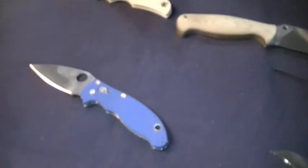And toughness, you mean the ability of the knife to take abuse, hits, shocks? I'm basing that basically on a Charpy test. They take a piece of steel, it might be notched in a given way, and then they drop a given load on it until it snaps the steel. And the amount of pressure or force it takes to snap the steel is an indication of toughness. With S30V, the toughness over S60V is at a factor of about 4 because of the addition of nitrogen in particular. Crucible continues with their metallurgical advancements. Now they have even new models that they've gone to the extent of adding niobium as a grain refiner to produce even a better, stronger steel.